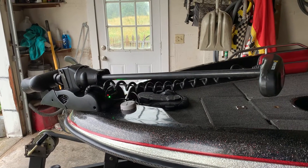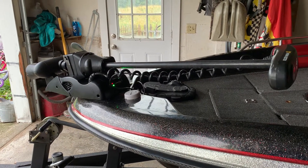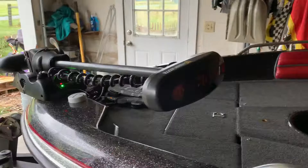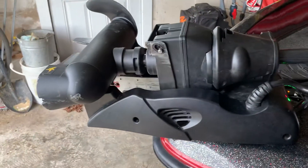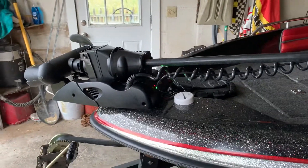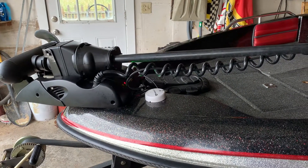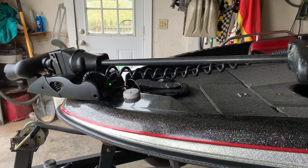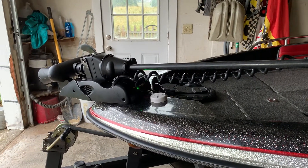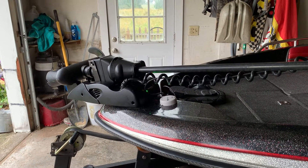There are a couple of videos out there about the Terrova — about taking them completely apart — that can give you an idea on how to do it. I didn't have to cut any wiring; I was able to coil everything up in the head. That extra wiring was left over from shortening the 15 inches, so if I ever needed to order a new shaft, you can get it from trollingmotorparts.com for around $150 — the original shaft and belt. So if I ever wanted to go back to a longer shaft for a bigger boat, that's an option. Anyway, I hope this helps. If you have any questions, leave a comment. Thanks guys.